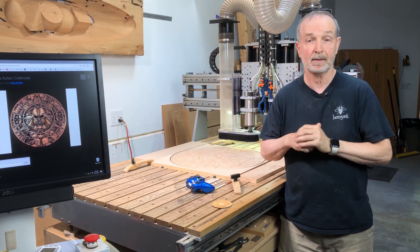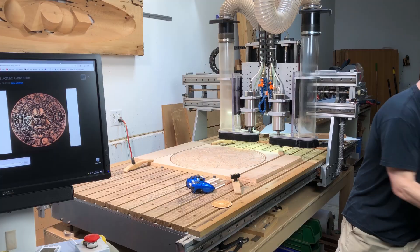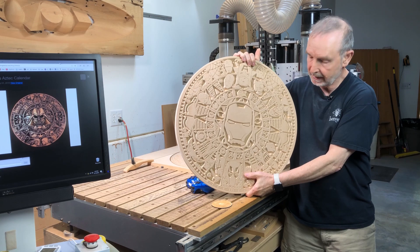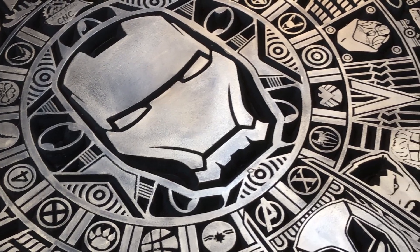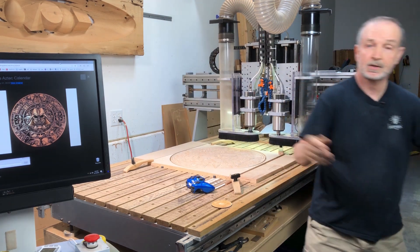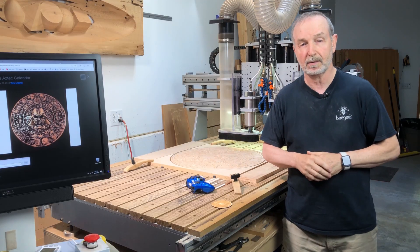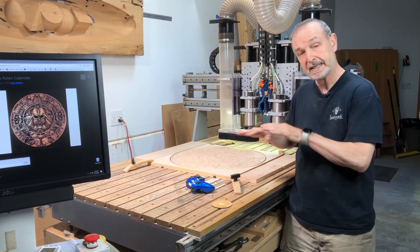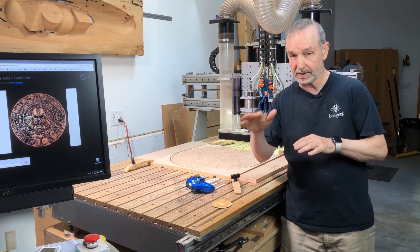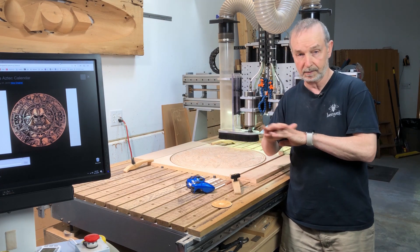I've also already completed one other calendar with the Marvel Universe. Let me show you that. You can see what these look like when completed — this one was done by San Diego CNC, another person on Thingiverse.com. I'm going to show you the finishing work on this as well. For the specifics: I used three-quarter-inch MDF and pre-sanded the surface really fine, because little scratches are going to show up in a paint job and there's not much opportunity to smooth the surface afterward.